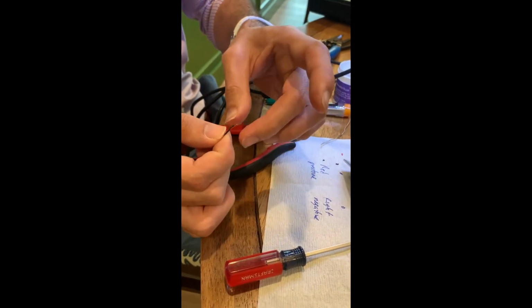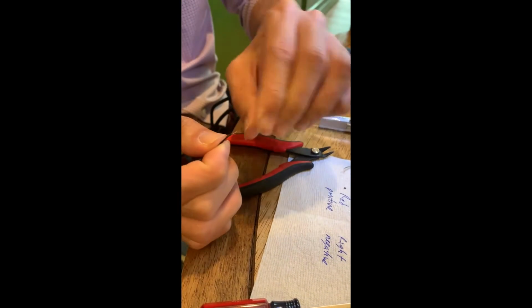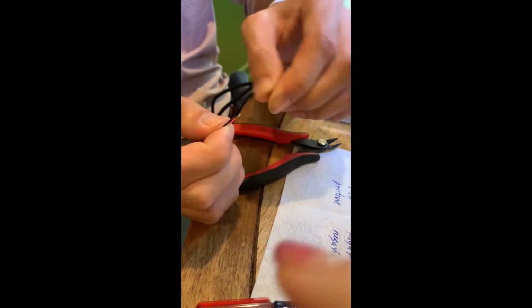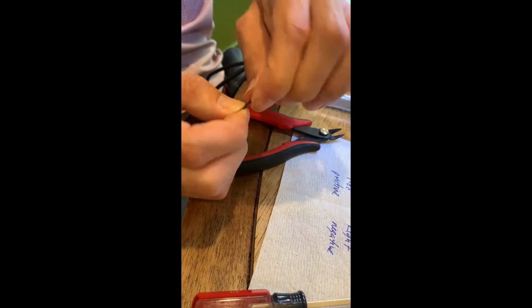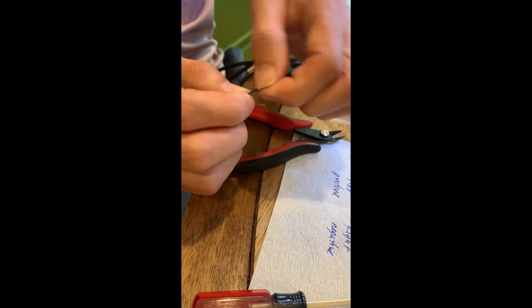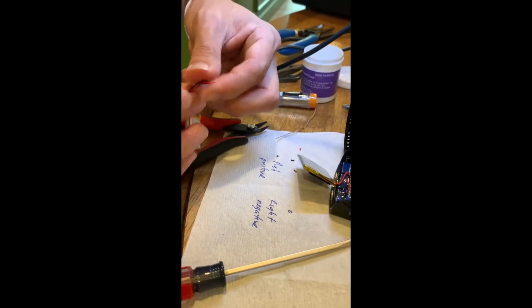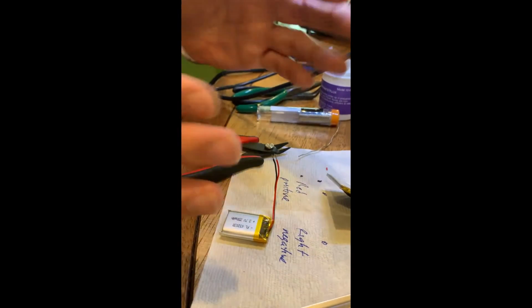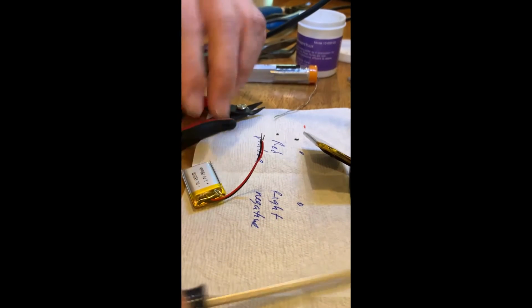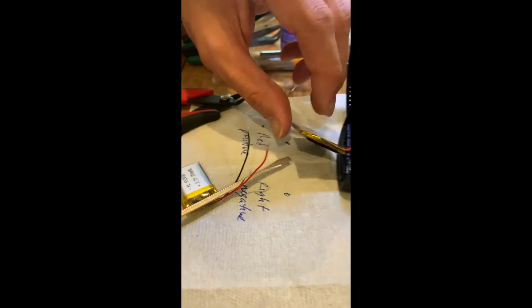Okay. So once these are off, these are usually braided wires, so to prevent fraying, you twist them. You just twist the wire. Oh, because they're actually little wires stuck together. Correct. Like little pieces of thread. Yeah. So let's just say there's 10 separate threads, and we're just twisting them to create a pigtail. So that way when you solder it, it's compact and tight versus sprayed out. Yeah. Okay.